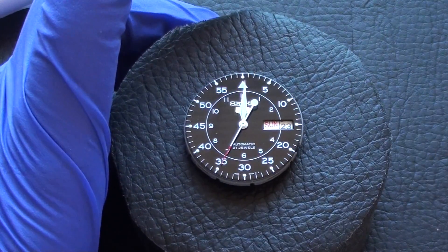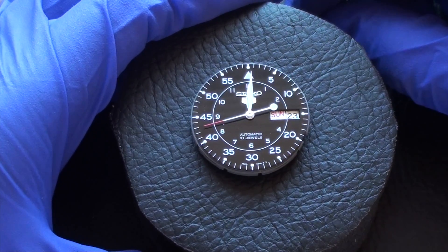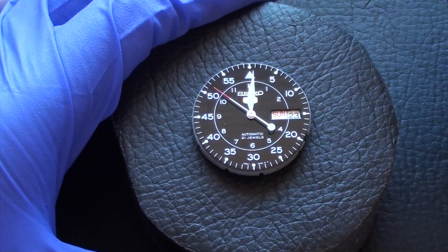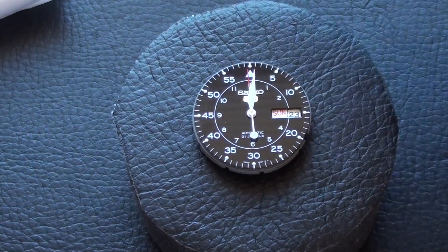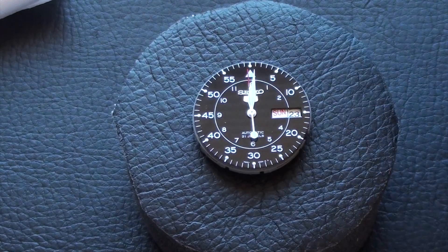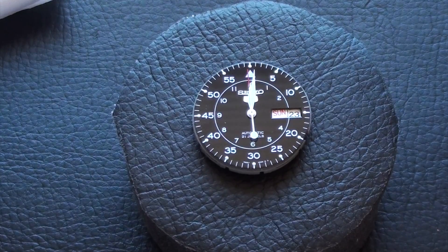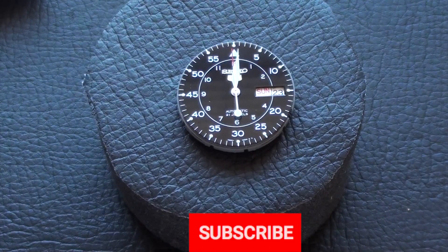So that's about it — that's how you install watch hands onto a movement. You just need the right tools and a lot of patience. Make sure everything is aligned before you push it down. Get in real close with the loupe to make sure everything is aligned with the cannon pinion; otherwise, if you push down without it being aligned, you can bend the hands and make them unusable. After you install the hands, take your loupe and look at the spacing between the hands to make sure they aren't touching when stacked up. Hands that rub against each other over time can potentially cause wear and also affect the timekeeping. Right here you can see the hands are spaced nicely — they aren't touching, so the placement was done pretty well. I hope you enjoyed this video; please smash that like button and subscribe if you want to see more watch videos like this.